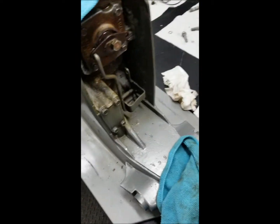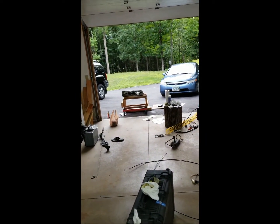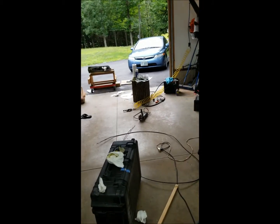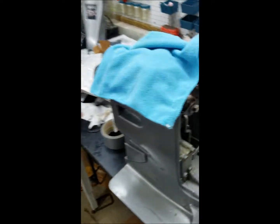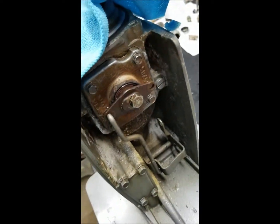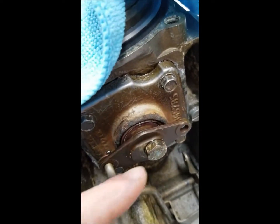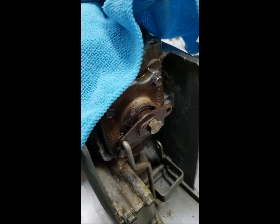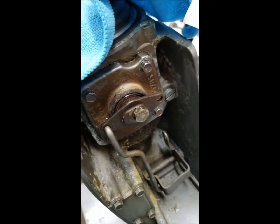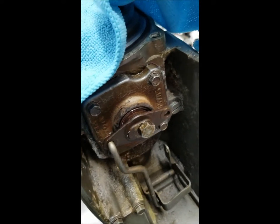We've made a little bit of progress. I'm really just waiting on painting stuff now — doing a touch-up on the lower outdrive. The painting, prepping, and sanding is really starting to slow me down. But last night I did install the shifter. Ended up replacing the seal right here because I got one in the kit — said why not, we'll replace it while it's out. Not too hard a job, plenty of videos and write-ups on that — pretty straightforward.